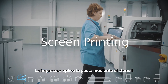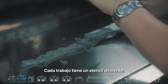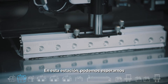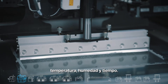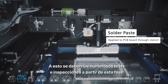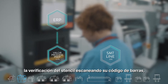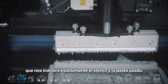The screen printer applies the paste through the stencil. Each job has a different stencil which is planned with Valor process preparation. It must be precise per product and per revision. At this station we can expect a relatively high rate of defects, as it is very sensitive to environmental conditions: temperature, humidity, and time. This is the reason for many tests and inspections after this stage. With Valor material management we can conduct stencil verification by scanning the stencil barcode and reporting the exact stencil and paste we have used.